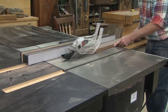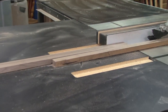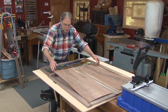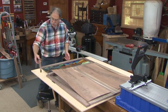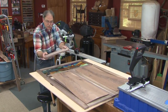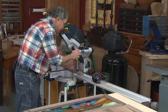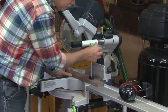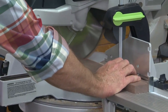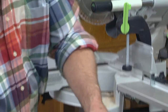For the stained glass, everything's 2 inches wide and the dimensions just match the glass frame. I take those work pieces — here are the two door assemblies, identical left and right. That green is going to be beautiful. The stained glass is trimmed out with this beaded face frame. Before I can bead it, I have to cut everything to the finished length. The rail, like a rung on a ladder, goes into the stile, which is the long vertical. The rails are 14 inches long, up against the stop — locked in place. Make that cut with dust collection, let that blade come to a stop, and that is a perfect cut, square every time.